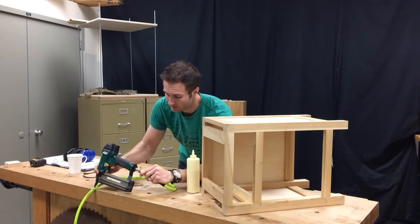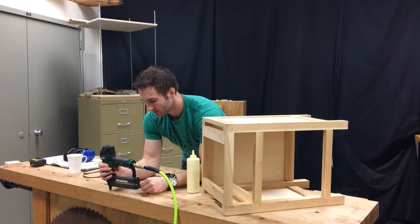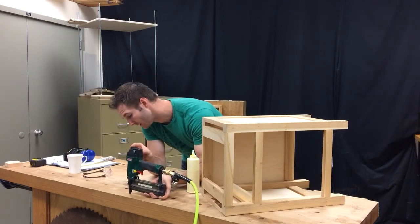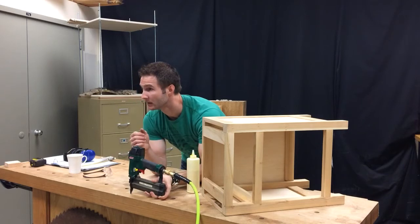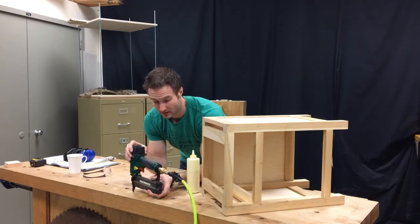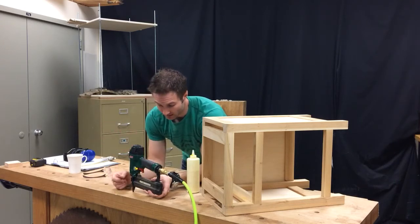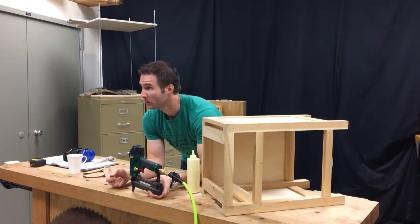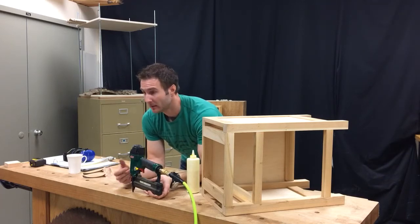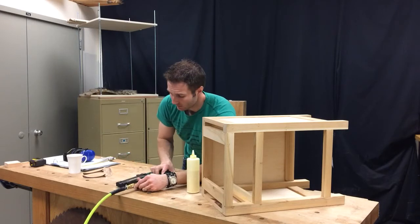Pull this little collar back on the air hose and there we go — air hose goes on. Now this thing is hot and ready to fire. There's also a safety on the front: that little button has to be pushed down before the trigger will activate. People have done a lot of crazy things with these. Consider it a gun — it's called a nail gun or brad nailer, and it's a gun by any means. Control the tip, control where you aim it. Don't pretend like you're going to shoot it at your friend, because people have been killed by these things. It's really nothing to fool around with.